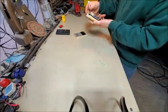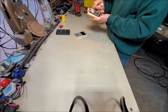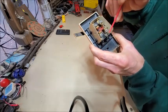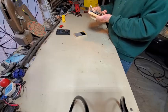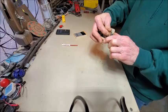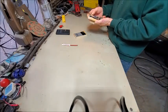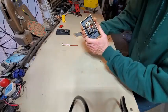This is defined by the manufacturer as Model M7-delta. It is a double line break — in other words, I expect this to be one on/off switch separated from the other as a second on/off switch. It also tells me that these are rated for up to 22 amps at 125 or 250 volts AC, or 18 amps at 277 volts AC — double line break.